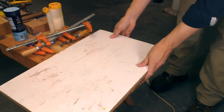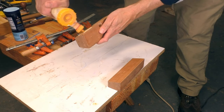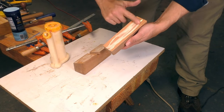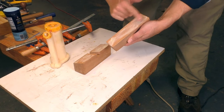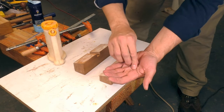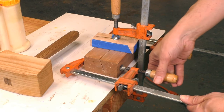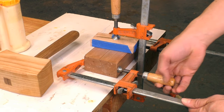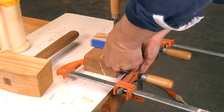I do a lot of glue-ups on this old melamine shelf — you can grab these anytime someone throws out a piece of Ikea furniture. They're very flat and glue won't stick to melamine. Big, flat surfaces like this tend to slide around during glue-up, which can really mess up the alignment of your parts, so I sprinkle on a couple grains of salt and use a three-clamp setup. One clamp from the top will keep the front piece from sliding up, and a clamp on each end will bring the seam tightly together. Those salt crystals will dissolve into the glue and just disappear as the whole thing dries.